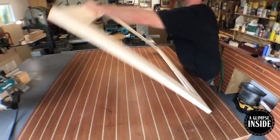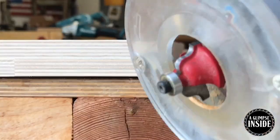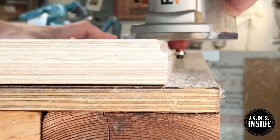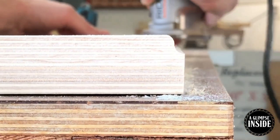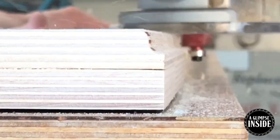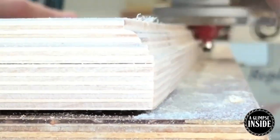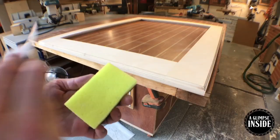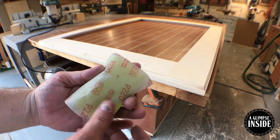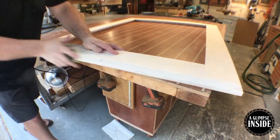At this point the frame looks pretty good. I'm going to sand it to 220 front and back and all the sides. Now it's time to use a Roman OG bit to put a nice profile along the edge of this frame. I'm going over the first pass with the bit about halfway down in the router, then the second pass with the bit all the way down, putting a series of coves and round overs in the piece. A quick tip: if you don't have a foam sanding block, just get a household sponge, wrap some sandpaper around it and you'll be good to go.